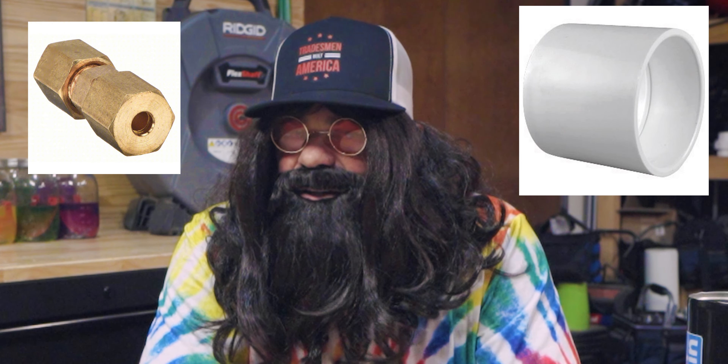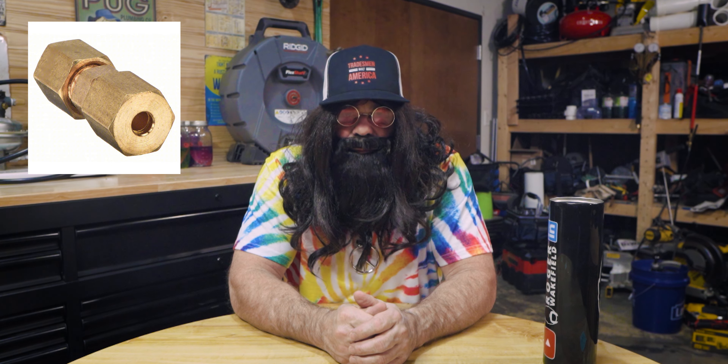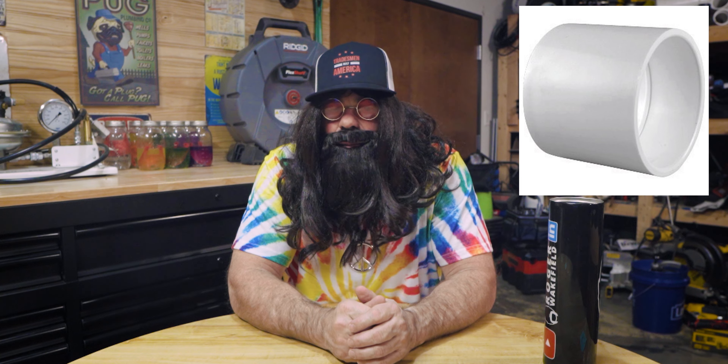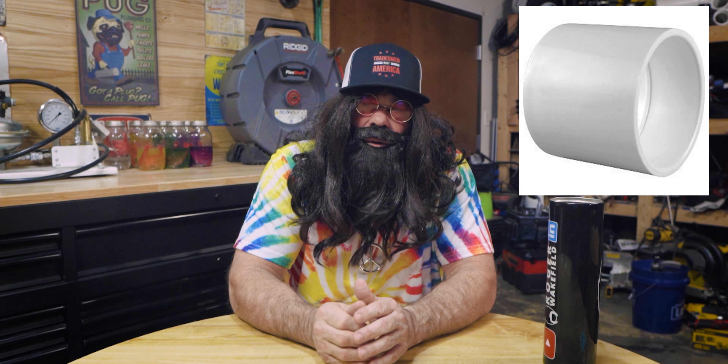You will see a few compression joints and slip joints around your sinks. Compression on the water lines and maybe some angle stops. The slip joints are on the P-traps typically so they can be readjusted and cleaned when needed. Look up under your sink — if your joint's leaking, call me, I'll come a-peeking. Sometimes it will be a flare joint for those water lines. I prefer stainless braided hoses that replace the compression joint. This joint is a little different, but I want to count it.